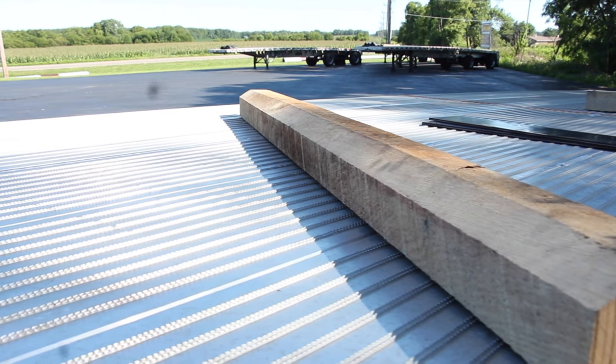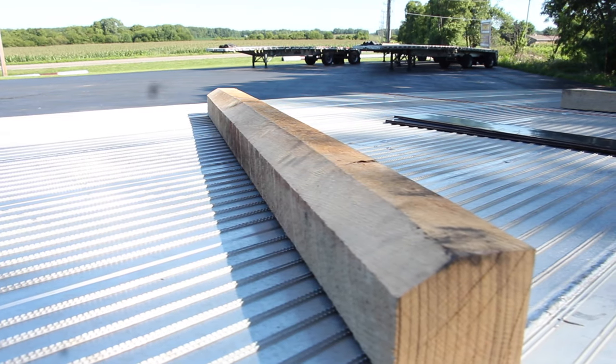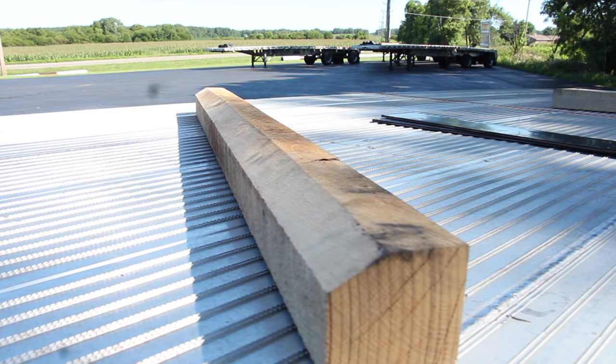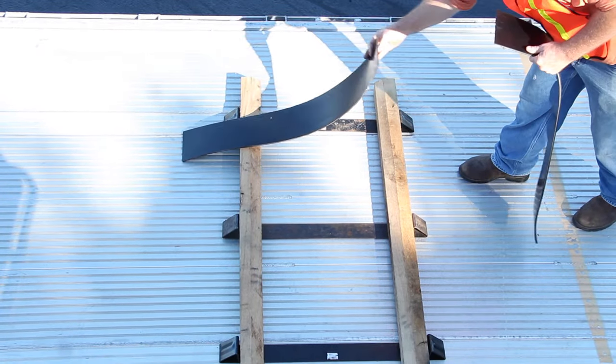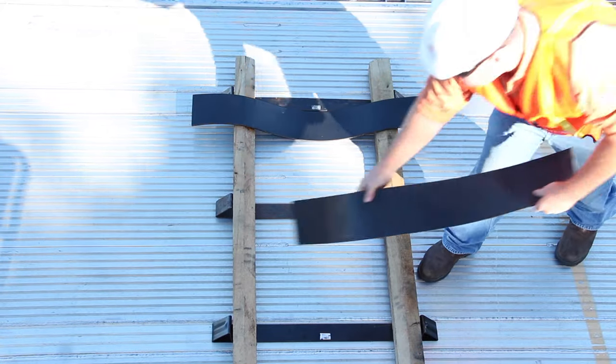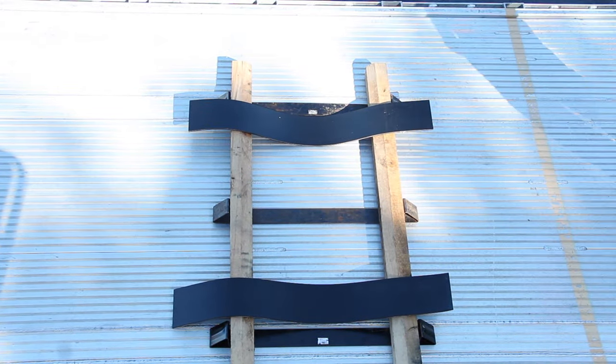Timber bevels must be facing up and pointed inward to the center of the assembly. The bevel on a coil timber is cut on a precise angle of 22.5 degrees. This ensures that the outside surface of the coil is sitting on a flat plane and not a sharp edge. Place rubber coil pads across the beveled timbers. This provides cushion between the coil and timbers and also provides friction to protect against lateral movement.